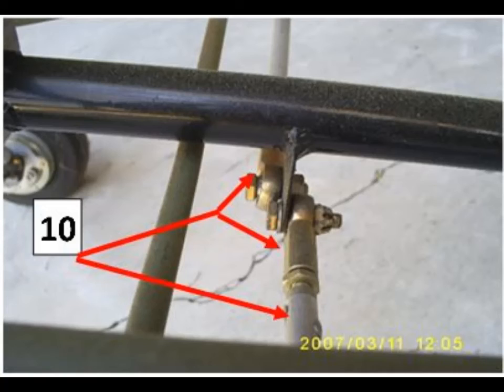Frame number 10 depicts the rod ends that are used on the push-pull tubes. The image shows the rod ends at the torque tube at the center of the cabin. We're using an aluminum tube rather than the steel tubes that were previously welded up with stud ends. The combination of the increased weight of the rod ends and inserts and the reduced weight of the aluminum tube results in essentially no net weight gain or loss. Taking any play out of the control system really makes a difference.